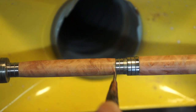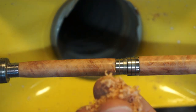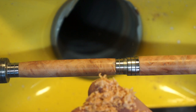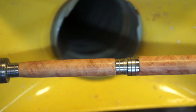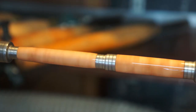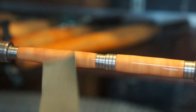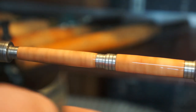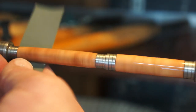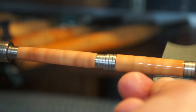Unfortunately, I've never had this happen before. I was just finishing the sanding at 1200 grit and just as I was finishing, a chip came out — look at that right there. Normally I would use the fine shavings to fill it up and put CA, but it's too late for that. I don't want to go through the whole sanding rigmarole again. I put five coats of CA on and then started to sand again — wet sand at 800, 1000, and now 1200 — just finishing that off.